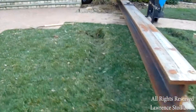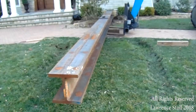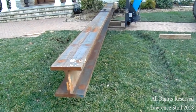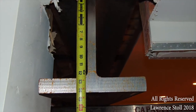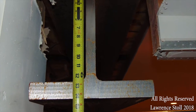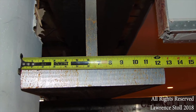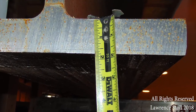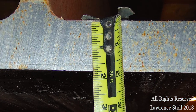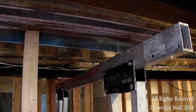Having the 25-foot beam in, we now need to get this 30-footer in there. This is the main beam that is going to be taking care of the two columns. If you remember in the basement, there was that hole we had cut into the foundation — that is the location where the columns are going to be placed inside of the wall right past that footing. Here you can see the thickness and width of the beam. The flange is actually an inch and three quarter, so this is a very large beam. We're not really going to get any deflection on this at all — it's going to hold the loads up above just fine. It's actually oversized.